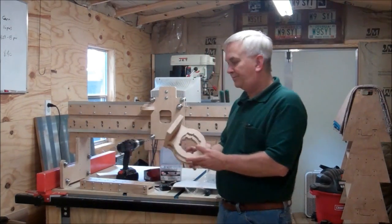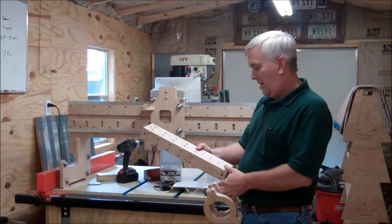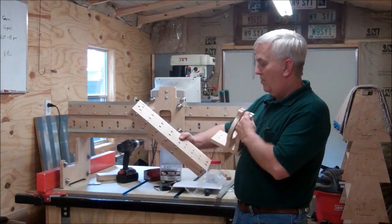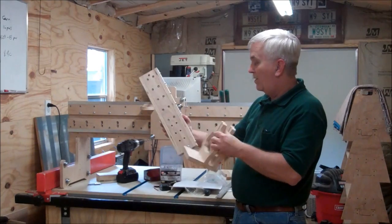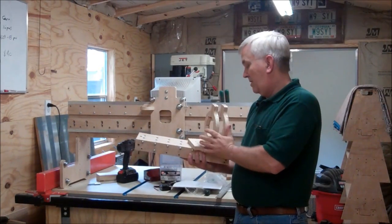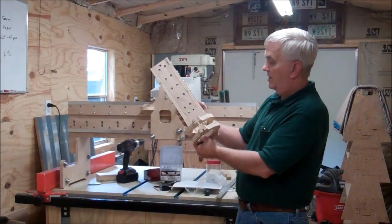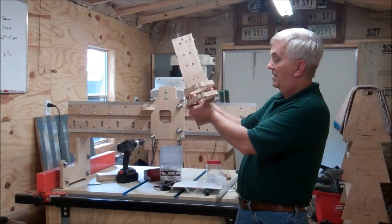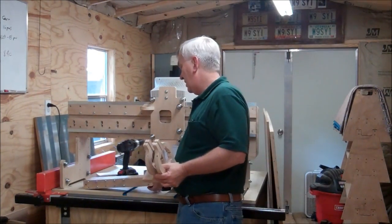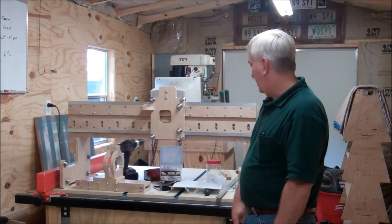I do have my router mount made. Jim wanted a few modifications — or actually he just made some suggestions and I said sure. With this one, I've got T-nuts in here to mount the router mount. You'll notice I've got three sets of holes here, so he can match all three up and have it set like that, or match just two of them and put it down lower, or if he's doing something thicker and needs added height, he can put it up higher. So he's got really about three different choices for how he wants to set his router height.